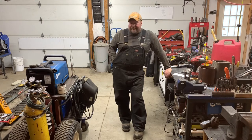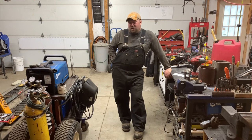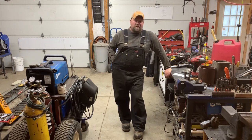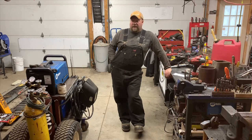I've got this little John Deere now — a heavier duty unit, 265 I think is the number on the side. I just got it running yesterday and it seems to work good. The motor smokes a touch when you load it down, but the hydrostat seems good and strong. The motor probably just needs a set of rings — maybe I'll fix it, maybe I'll just drive it. It's just a picnic table.